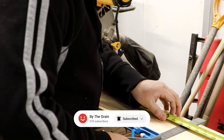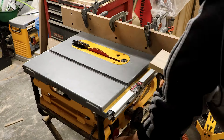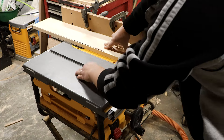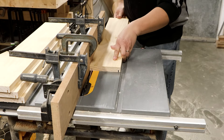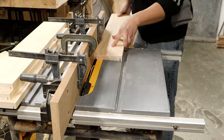I started by scoring down three-quarter inch pine boards then cut them down to full width and length of the watch case. For this initial project I'm using a very large top glass display and half-inch maple plywood for my bottom base. I used a table saw to rip some groove cuts on the exterior boards to seat the bottom panel and top glass.